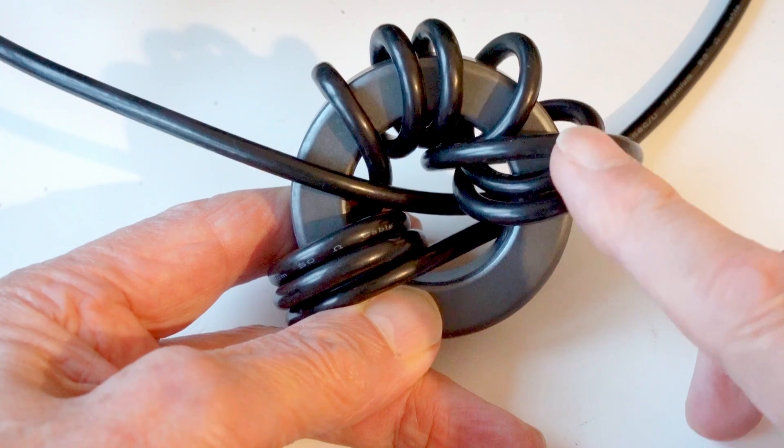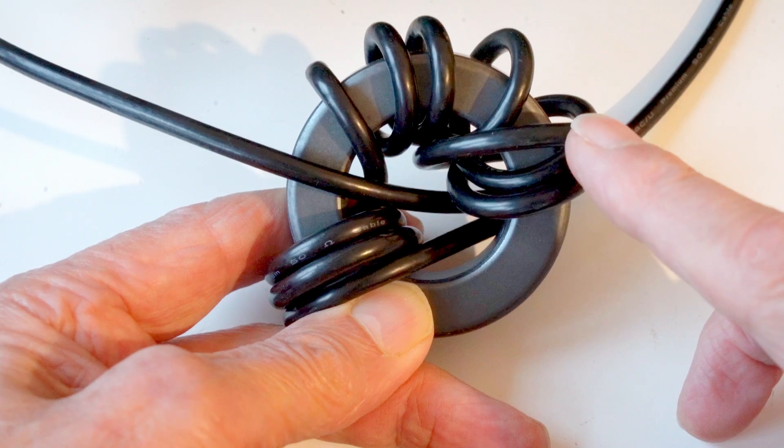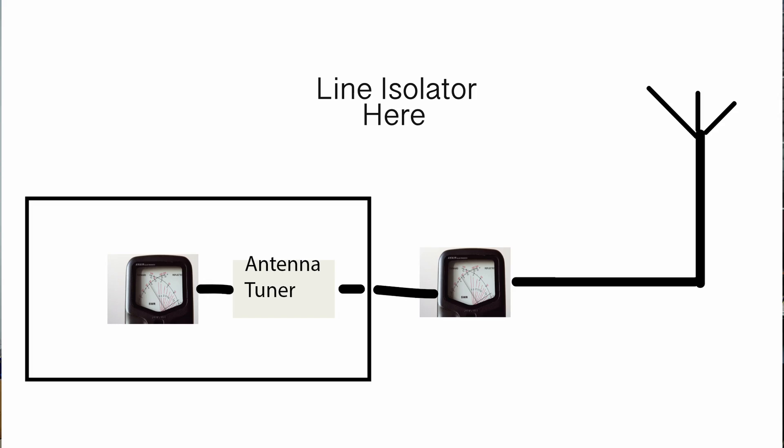The way to overcome this is to install a line isolator. I use a 240-43 ferrite core — the actual material is not overly important, provided it's suitable for this application. The diameter and even the number of turns aren't critical. You can actually get away without a ferrite core simply by winding about 10 or 12 turns of coax cable around a form of around 4 centimetres diameter. All you're trying to do is quench the RF on that outer sheathing. Please remember to use one, because without it you can get errors — and it affects not only an external VSWR meter but also the readings on an internal one. So be cautious.